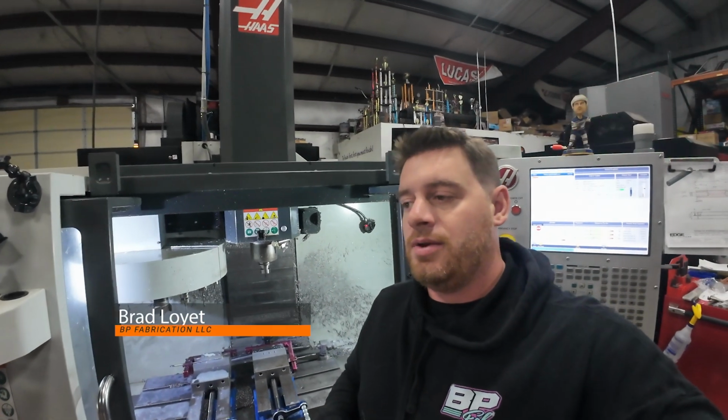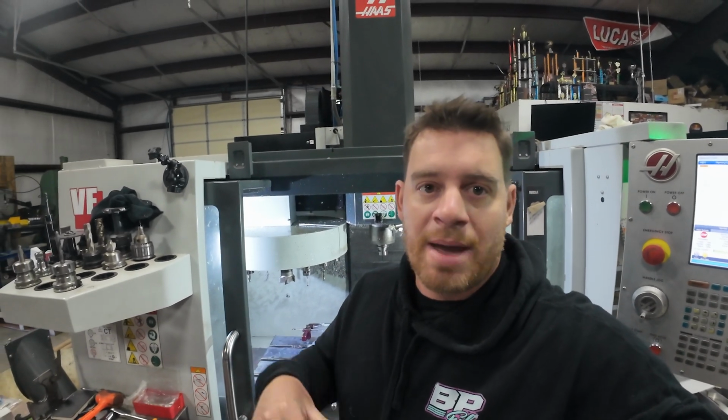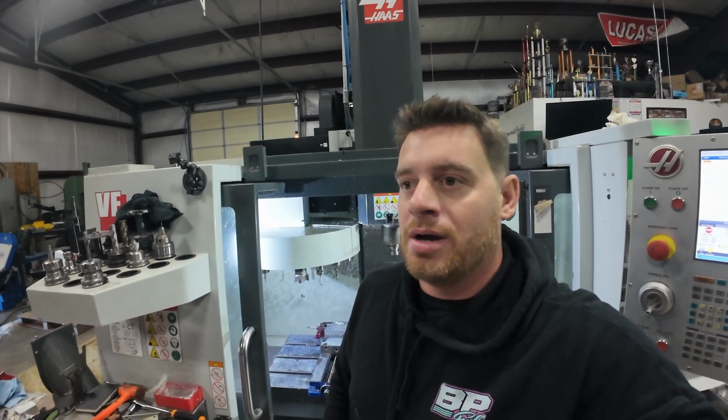Hey guys, today I wanted to talk to you a little bit about a process that we've started doing in the last year, which is thread milling. We used to always use a tap and rigid tap on the machine, and we'd run into a lot of issues where the tap would get gummed up, threads would get messed up, or we'd break a tool, and eventually it just got to be annoying. So what we started to do is thread mill stuff.